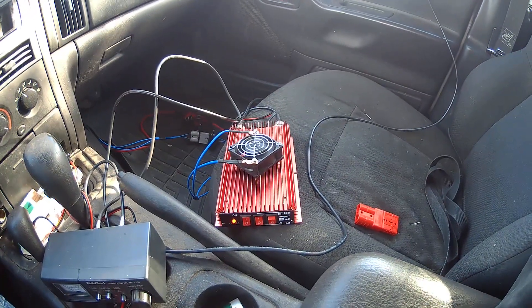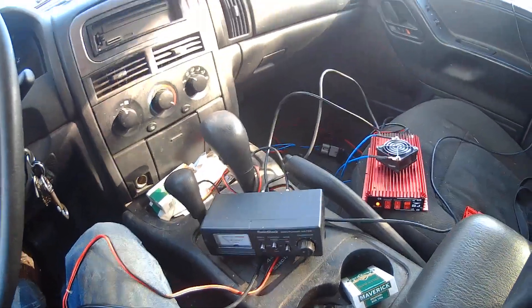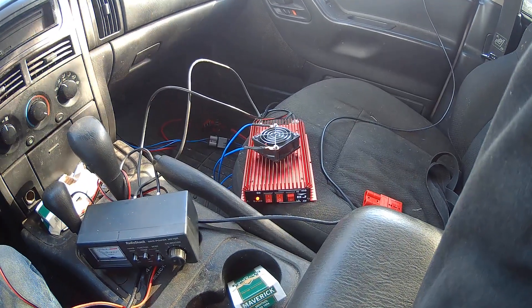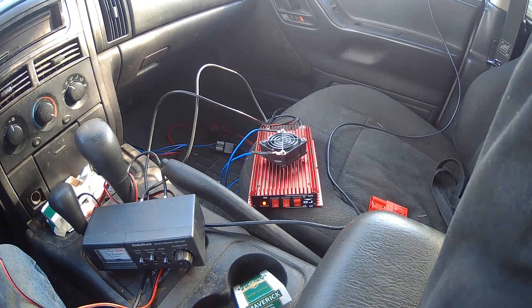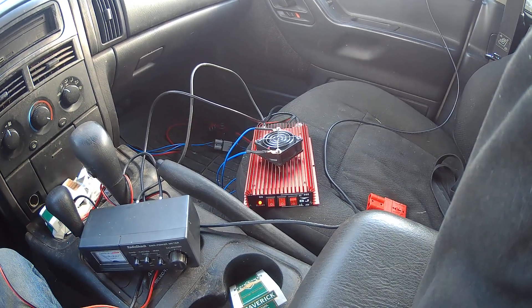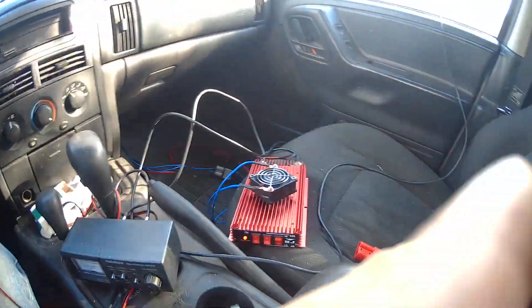I love these non-gender connectors — one connector does both sides. The linear has a fan to keep it cool. Everything is good quality — I didn't buy anything cheap. Super 60, that's what I recommend you do to hook your linear up instead of having an external battery and dealing with ground issues and an external charger. The RM Italy KL-503 you're running doesn't run more power than this 300, and you can easily run it off your battery if you upgrade it, especially with your motor running.